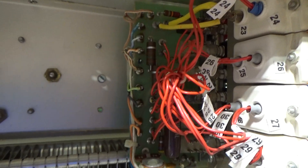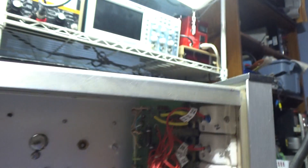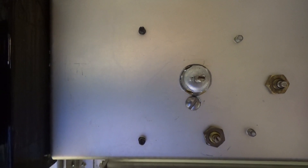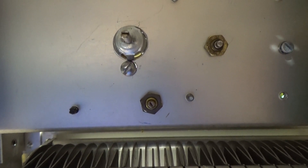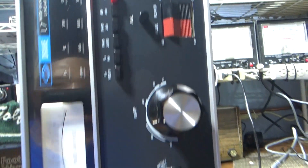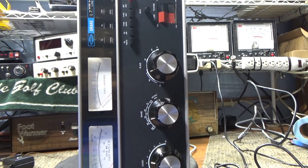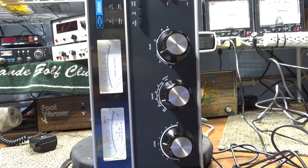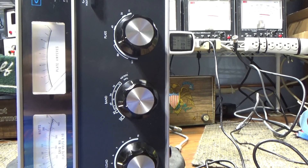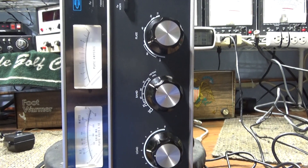The meter board is where you switch in the readings from the watt meter, grid meter, and amp meter. This is the other side of the input circuit with the variable input choke and the tuning and load capacitors on the input side. That's about it to this amp — it's about ready to rock and roll. The power supply is about ready too. This has been a walkthrough of the Drake L7 RF deck — mono-banded with a variable bias on the front instead of a band switch, mono-banded for 10 through 15 meters.